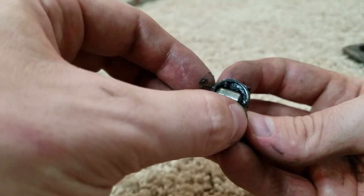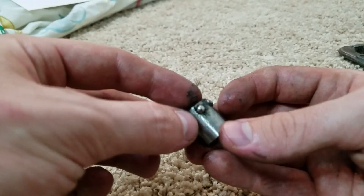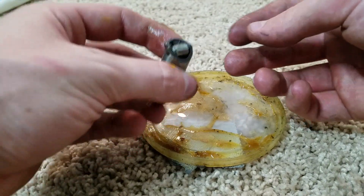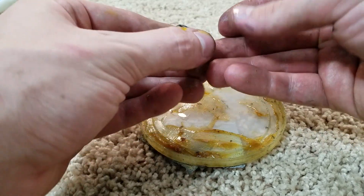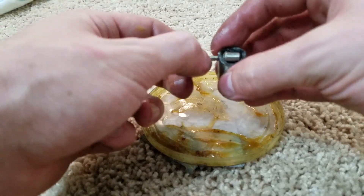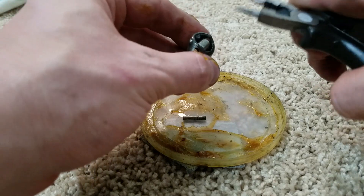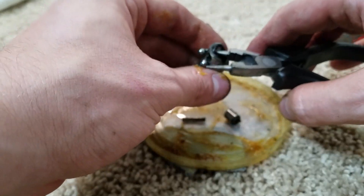If you want to clean and regrease it, the little ball bearings on top will fall out now that it's removed — nothing is keeping them in. You can grab those and take them out. There is a pin that goes through this whole thing all the way across; all you need to do is push that out with something that has a pointy end. Take that out and the roller should come out, along with the little ball bearings.